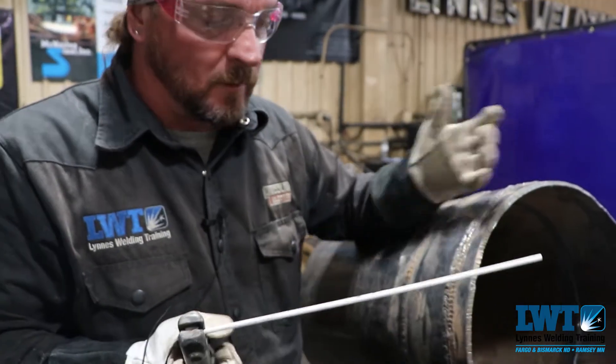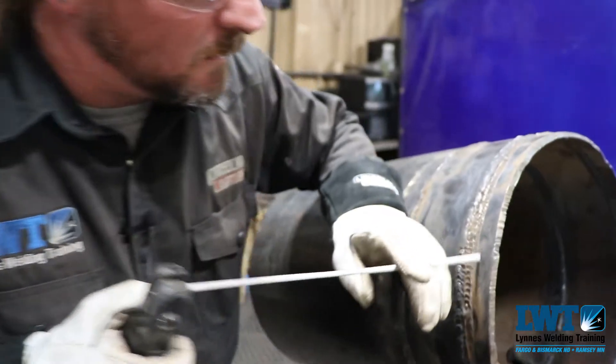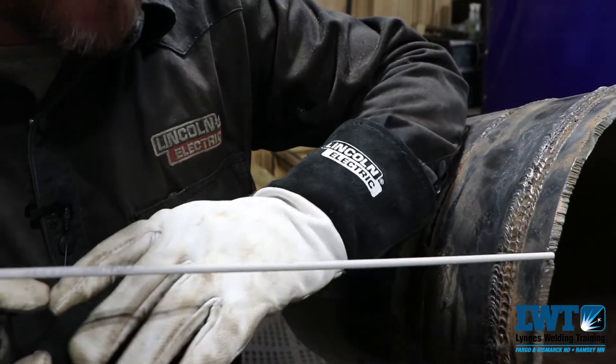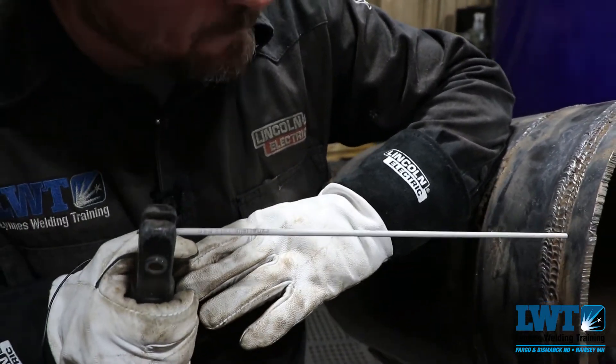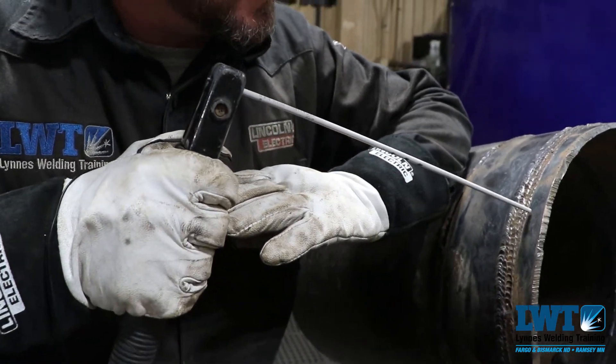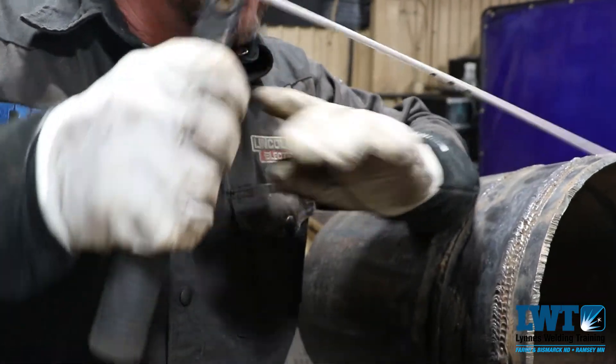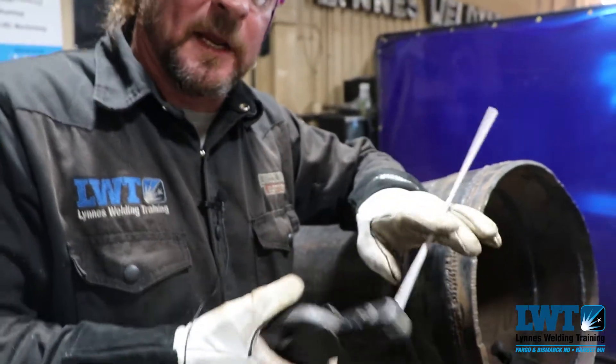In this case we're just doing a little bit of pipe. So I'll show you again — I'm going to grip to light, transition back, and then I can drop back into my tie-in and kind of work that movement up. Just like that. That way the fingers are never riding the rod.